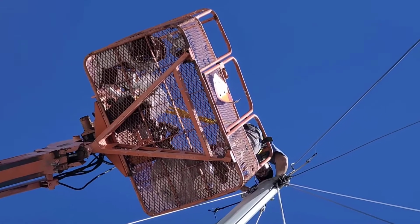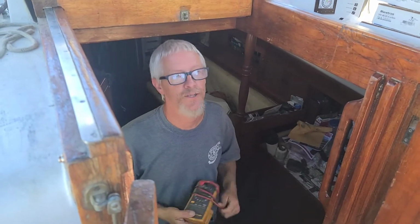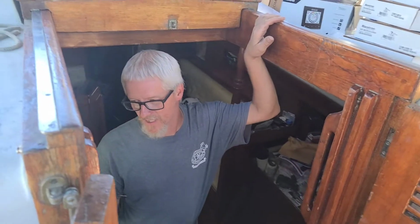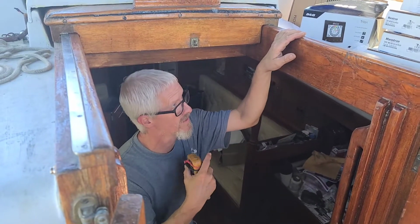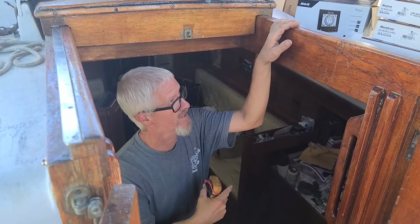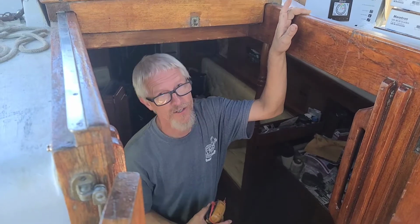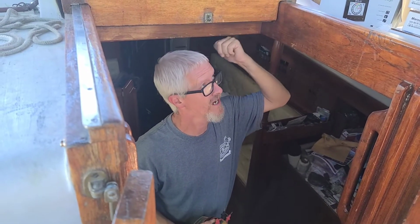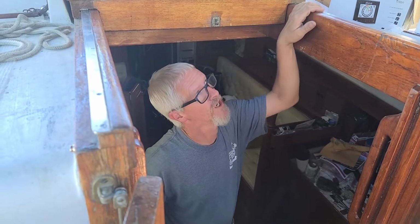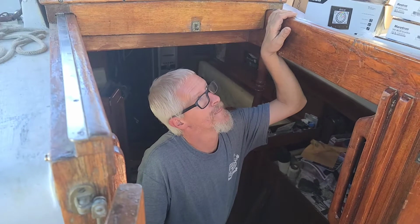That's not there. Okay, typical sailboat maneuver. The wire going from the breaker panel to the step is non-operational. They disconnected that, so there's no power on it. Right. They ran a bow and stern, a red and green navigation light, up to the bow rail. They did? That's typical of sailboaters because they don't want to go up to the head of the mast to fix the problem. I'd rather have the masthead light.